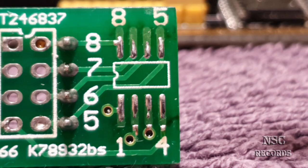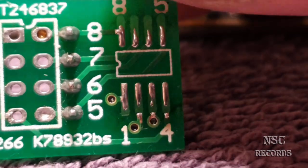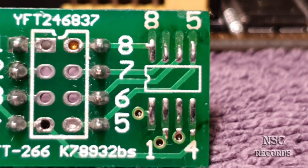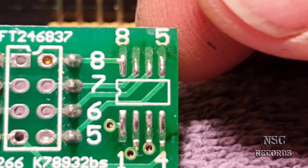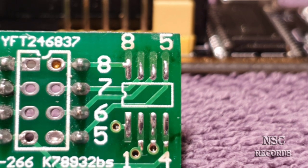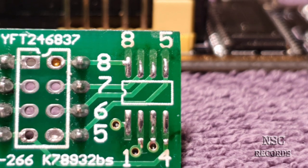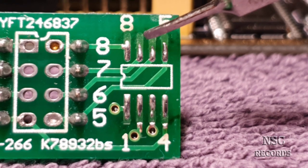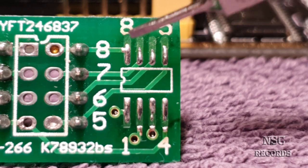The chip has just no contact — you maybe don't know why, and here's the reason. You might be able to solder it on the side down there, but you're going to have no contact. That's the problem. This is a big issue. Now, what I can recommend is that you solder at around 360 to 380 degrees — set your soldering iron to about 380 degrees maximum — because these small PCBs get really hot and the pads get destroyed faster the hotter they get.